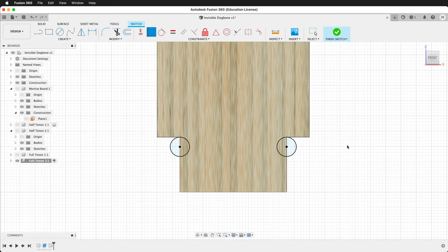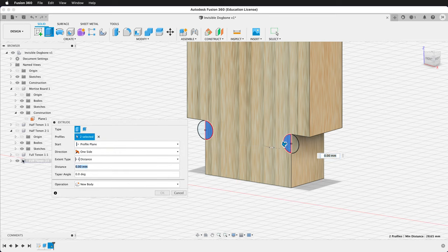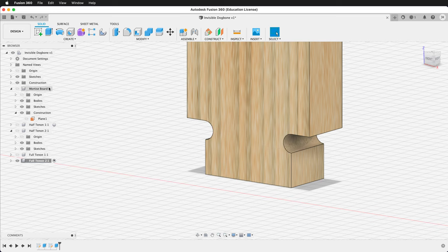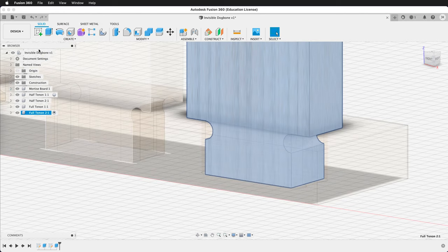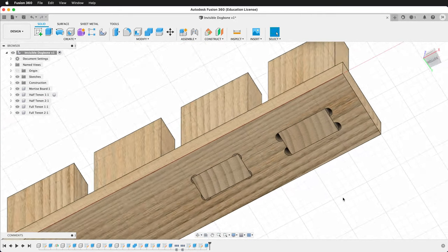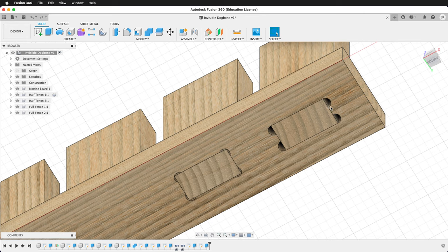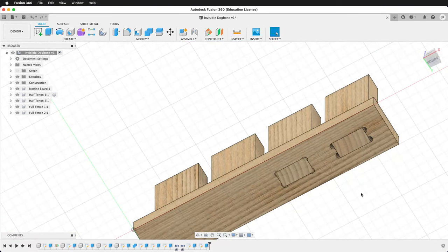Once they are coincident, finish the sketch. Press E to extrude, grab the two half circles, set the distance to negative ply. Unisolate Full Tenon 2 and activate the top level component. The T-bone tenons really make it look nice on the top, whereas the dog bone fillets cut into the board and are not the most attractive. If you look at the bottom when making a through tenon, this can leave much more space, so a traditional dog bone is likely a better choice. But for half mortises and tenons, use the T-bone fillet.